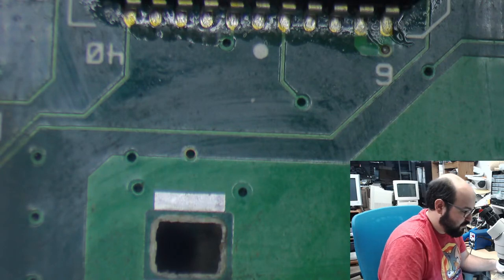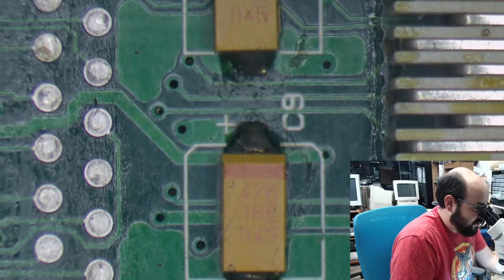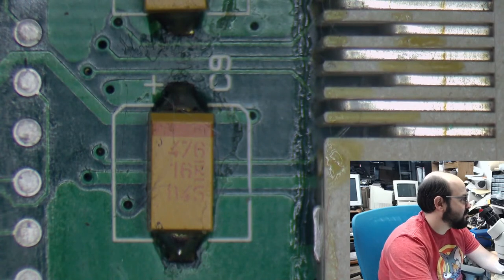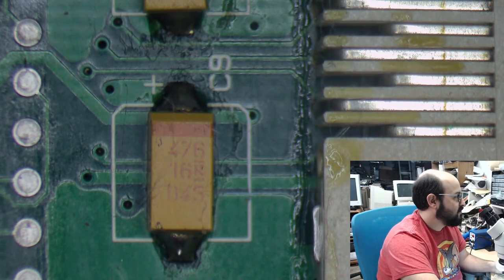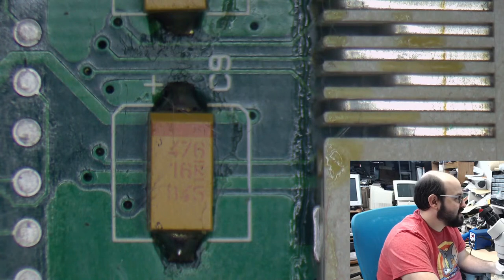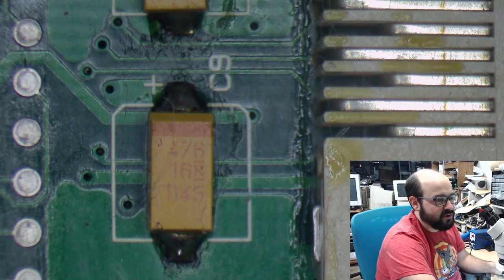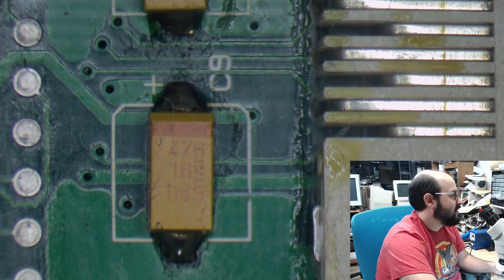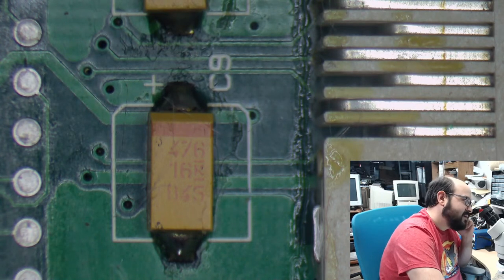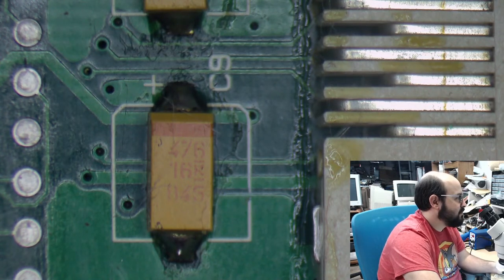Okay, so yeah, this board is a Color Classic, and you can take a look at the capacitors here. I'll talk a little bit while I look through my notes. You can see the capacitors here are so close to this plastic edge, and that just makes it so difficult sometimes to do these repairs. Because with the way those capacitors are and the plastic, you have to heat up those capacitors pretty hot or use a soldering iron close to them or a heat gun, and that sometimes melts that plastic right away. So you have to be very, very careful. Use heat shields and all this stuff to really get that stuff out of there, because removing those caps is pretty simple, but you just got to be very careful with the heat. Otherwise, you could easily run into a problem.